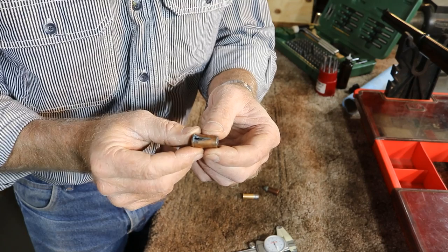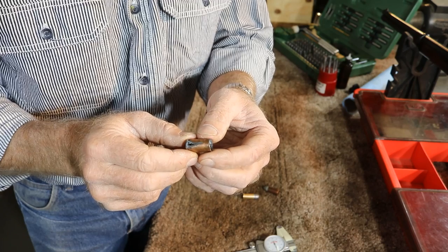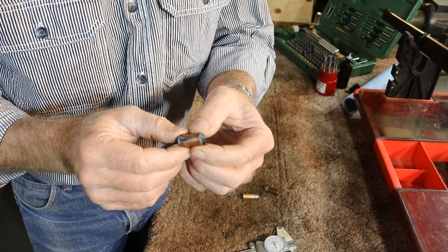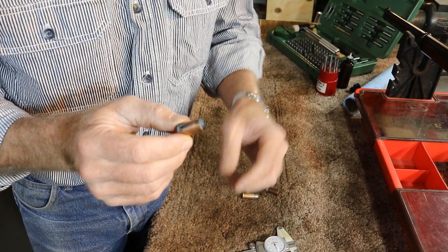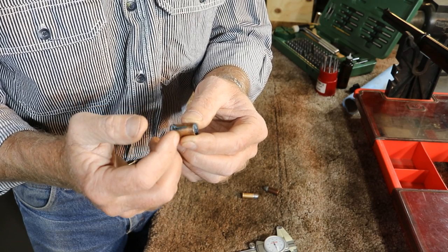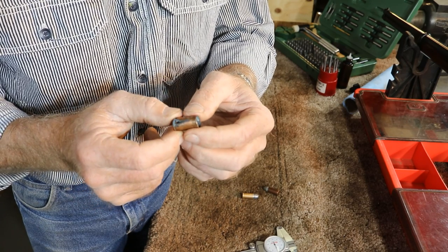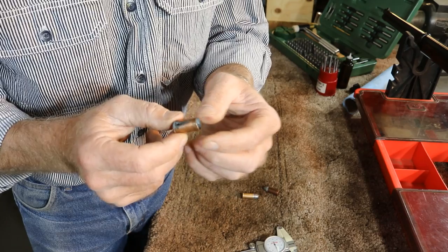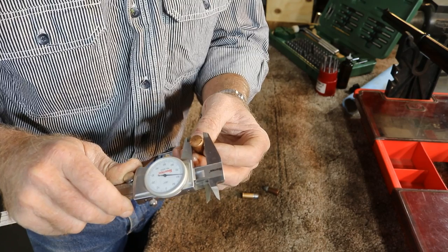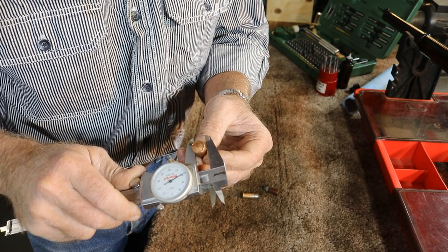When we ejected the cartridge, we found the culprit. You can see it just got a split right down it. We knew that this gun had a little bit of extra headspace, which is really common with the older Winchester toggle-link guns. It shouldn't really have been a problem because these 44 Henrys are a straight-walled cartridge, so even if the case backed up a little bit it shouldn't have created space for the cartridge to expand and split like it did. If it was a tapered or necked cartridge, we could see problems arising. Let's mic this case — we're seeing between 475 and 480 depending on where we measure.